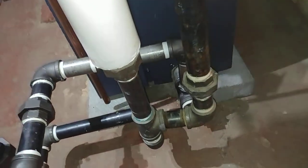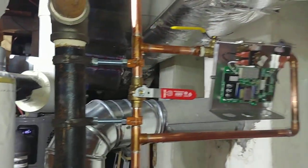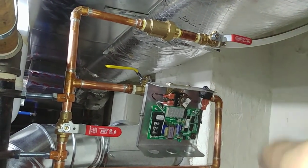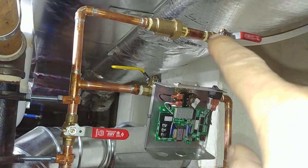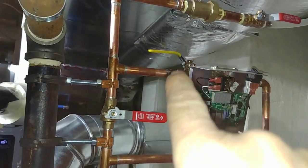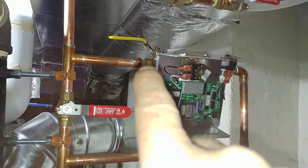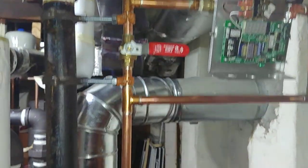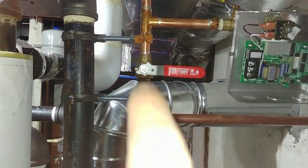This is the drip from the two dry returns, and that is the VXT — you may have seen it in an earlier video. PEX goes into an iron pipe thread size shutoff, backflow preventer, and a service valve there which is a three-eighths male by female. I've reversed the flow of the VXT so that it fits tighter into the package. And that's our manual bypass.